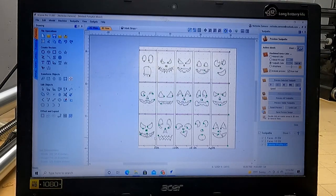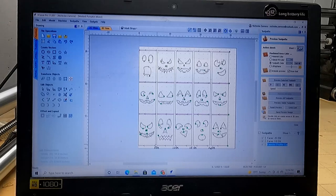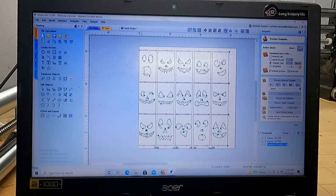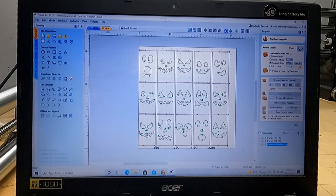I bring them to the table saw first and rip them down, I think, to 5 1/4, whatever all the other ones come in, and then put them in here. But the way this is set up, you could fit a 6-inch one here, and then because the faces don't go all the way to the edges, it's still pretty forgiving. So if yours are cut too short, or if this one's bumped over a little bit, you'll still be fine when this all cuts.